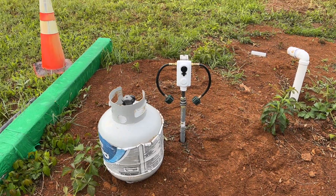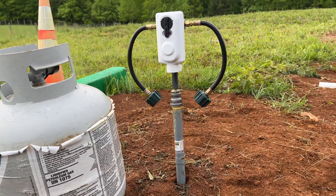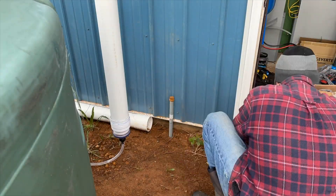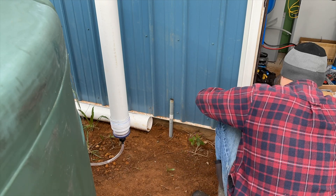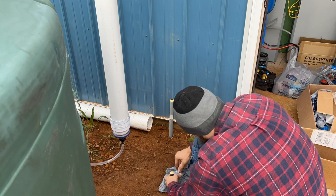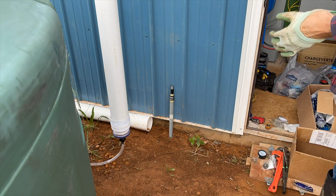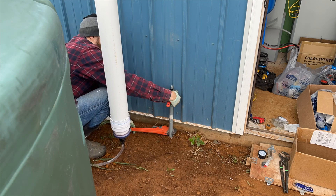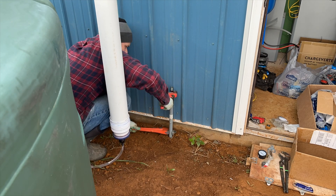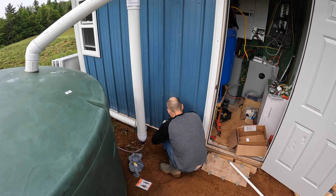Here is a close-up of the propane tank next to the regulator. I purposely chose this height so it would be the same height as the propane tank. Moving on to the other end, I'm taking off the three-quarter inch cap and replacing it with a reducer to bring it down to half-inch pipe before turning 90 degrees towards the building and entering through a hole in the wall. I always wrap the Teflon tape around the threads first, followed by a thin coat of yellow pipe dope, then start the threading by hand before switching to the dual pipe wrench strategy.